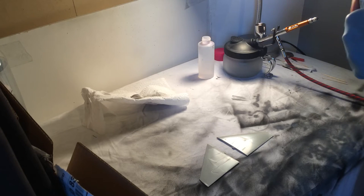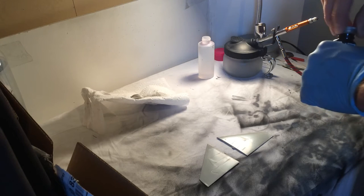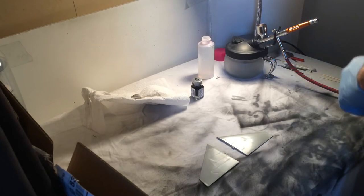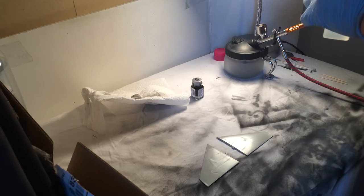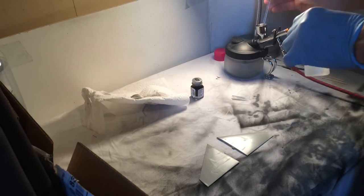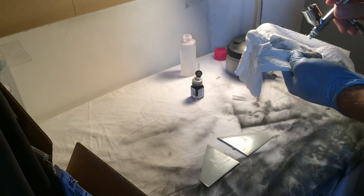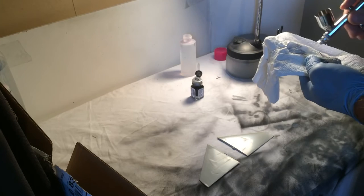Sorry if there's not enough light — I'm using my iPhone camera with a camera app so lighting might not be great. Before you put paint in your airbrush cup, you want to turn on the compressor. I have it set to about 10 to 16 PSI. I'm putting lacquer thinner into the airbrush cup to run it through, just in case there's any gunk in there, to get old paint out of the needle and tip so my next paint session won't clog up.